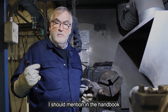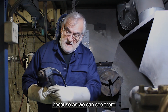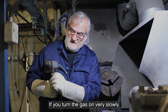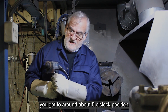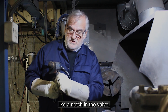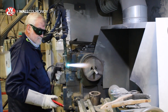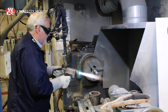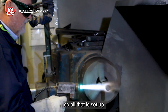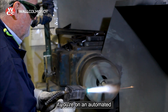Just before we light the torch, I should mention that on page four of the handbook there's a lighting procedure, and it's really easy to follow. The lever is in the off position, pointing down around the six o'clock mark. If you turn the gases on very slowly you get to around the five o'clock position, and you can feel a little bit of resistance like a notch in the valve — just hold it there, light the flame, and then open the valve straight up. So there we have the torch lit, and as normal we have to make sure we have a strictly neutral flame. All the settings are made on the main control panel in accordance with the handbook, so it's fully repeatable.